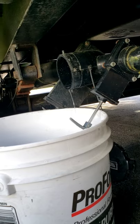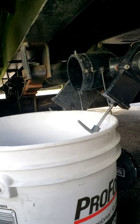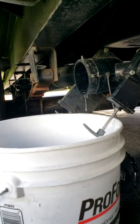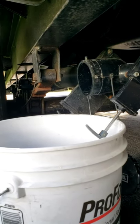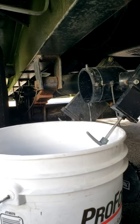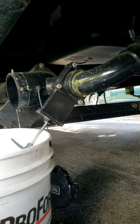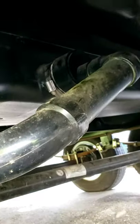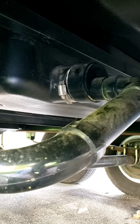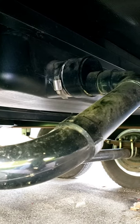What we're doing is draining the gray water tank of the antifreeze and water I put in it from winterizing. I blow all my lines out so they're completely free of water, then put antifreeze down the traps, so there is some water in the gray tank. I've got a bucket under here to catch as much as I can so I don't get soaking wet. Right here is the gate valve I'm going to take off, and up in there is the clamp I need to remove — it looks like it has plumber's putty around it.